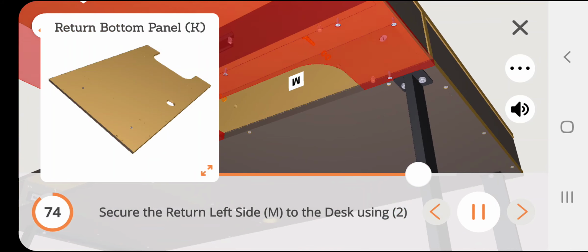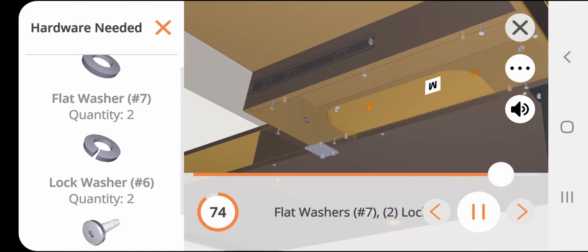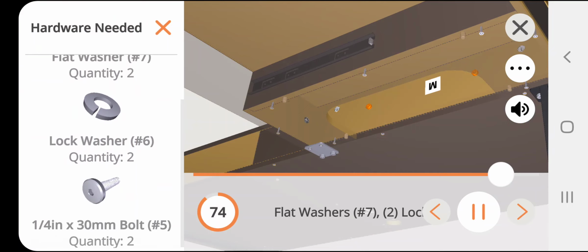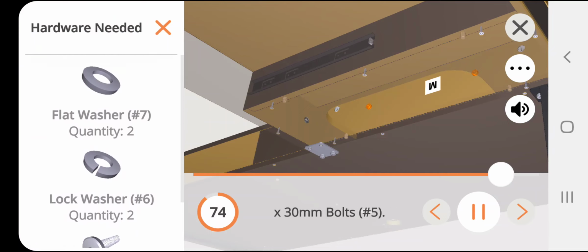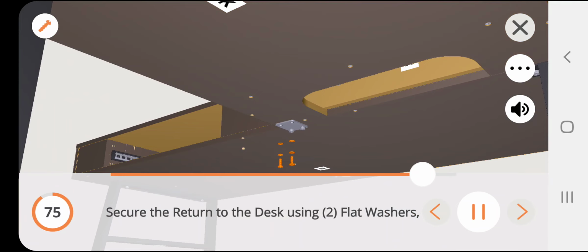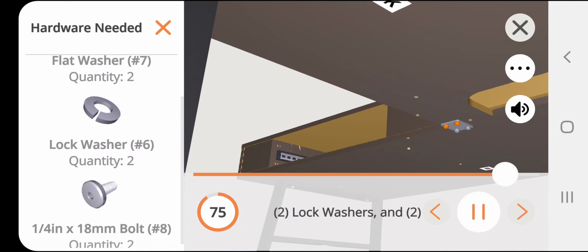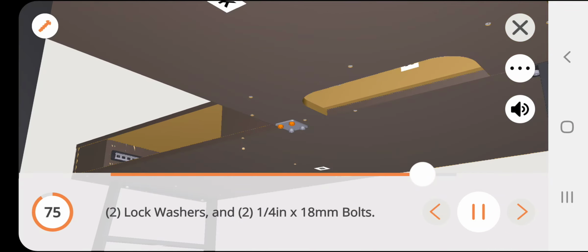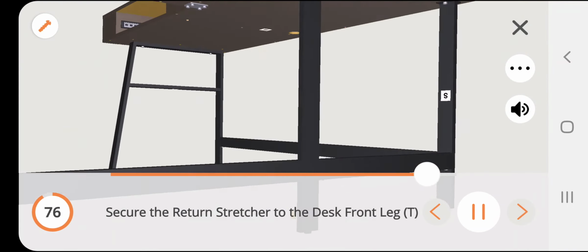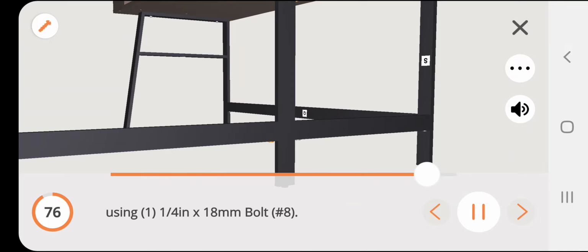Secure the return left side, M, to the desk using 2 flat washers, number 7, 2 lock washers, number 6, and 2 1/4 inch by 30mm bolts, number 5. Secure the return to the desk using 2 flat washers, 2 lock washers, and 2 1/4 inch by 18 millimeter bolts. Secure the return stretcher to the desk front leg, T, using 1 1/4 inch by 18 millimeter bolt,